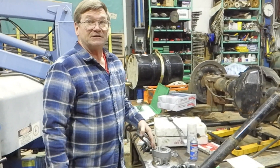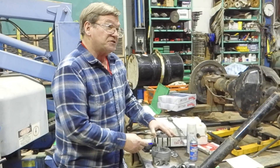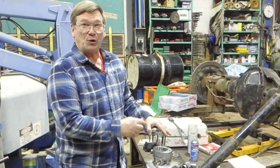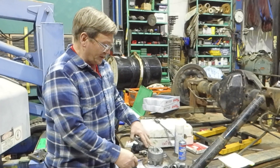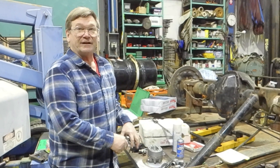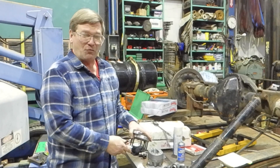There was one many years ago I was working with and helped troubleshoot. It was a double — they originally had two pumps, and then instead of using two pumps they used a single pump that was a double chamber. So it had two gear sets pumping oil, but they were pulling the oil out of one common inlet. Between the two of them it was sucking too much oil, and it would burn up in a matter of 30 seconds. It was really amazing at how quick it would burn up for lack of oil, with brand new pumps.